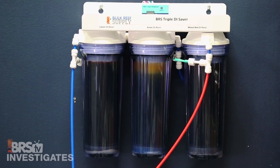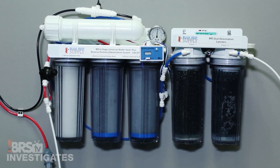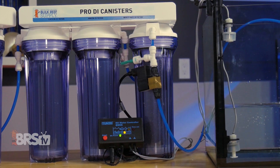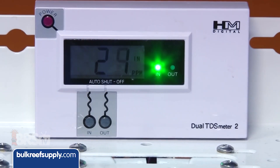your RODI will only be running long enough to produce that five gallons, and that initial burst of high-TDS water from the membrane housing ends up going through the DI resin more frequently than if you were to use up all 50 gallons and then replace all 50 gallons — which would mean you'd run the RODI filter 10 times less often, meaning 10 times less TDS creep.